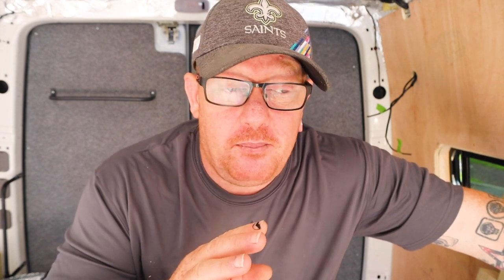We need to get the same one of these in on the other side. Take into consideration there's a load of cables in the trunking — this could go absolutely swimmingly or it could be a total disaster. It's just going to need time, patience, steady drilling, and going through a little bit at a time. You don't need to go right the way through with the drill because if you do, there's a chance you might destroy a cable and then the whole wall is going to come off.